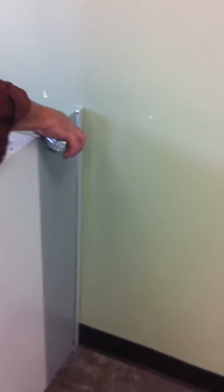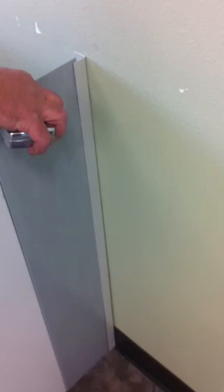What you want to do is get the wall cleat on the inside, and this is a good thing to note. The cabinet in the wall cleat is touching the wall here, but the wall is falling away from the back of the cabinet. So that acts as a scribe, because there are some variances in walls. Our set distance right now is going to be 7 3/4 of an inch.